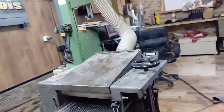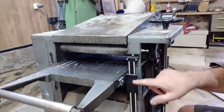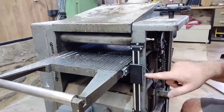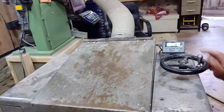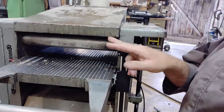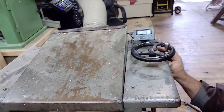What happens is this has got an optical sensor — it might be magnetic, but I believe it's optical — and it knows exactly where this part is in relationship to that part. Because this is fixed to the table, it sends a signal down the wire to the digital display. If I turn that on, you'll see it's currently saying the distance between the table and the cutter block is 36.58 millimeters.